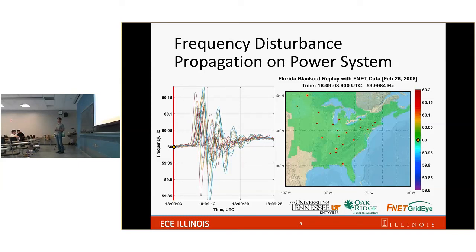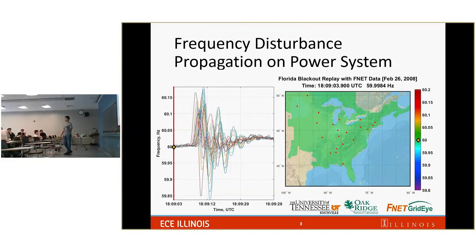Okay, so if the primary control kicks in, will that have any impact on your cross correlation? Because as I understood, there is no control knob specifically taking care of the torque input from the turbine. Yeah, that is another thing we are looking at right now. We know that the swing equation works very well. But now let's use a higher order machine model with the primary control incorporated, and see how it would change this behavior.